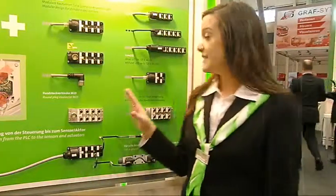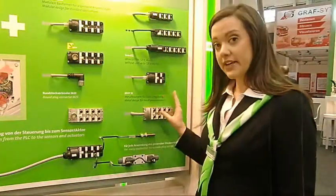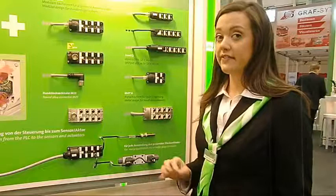You can either decide to use a fixed cable or a pluggable main cable with your distribution box. Fixed cables are mostly used when you have a non-moving installation. But if the cable is used in a flexible application or in drag chains, for example, a pluggable solution is the best advantage for startup and service. With the pluggable cable, it's easier to monitor and set up your machine.